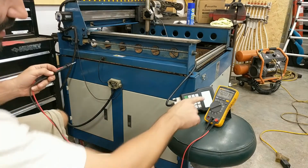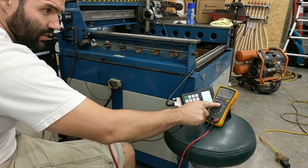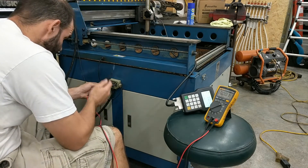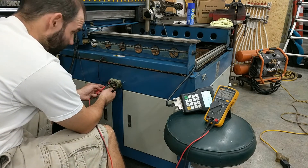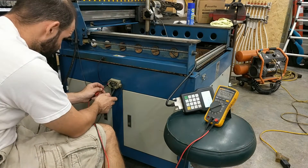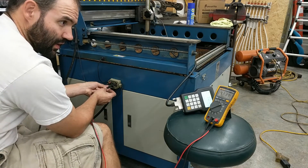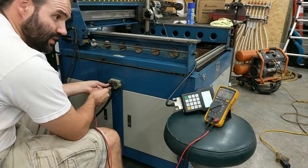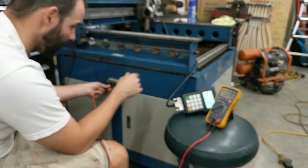Let's look at what that does electrically. You can see my voltmeter here. I have this set on volts DC. I'm going to put my red on 24 volt and my black on the black sensor wire for the Y axis sensor. I'm getting 4.3 volts. And if I test the X axis, I'm getting 6.8 volts. I don't know why they're different.